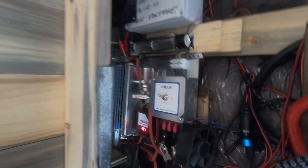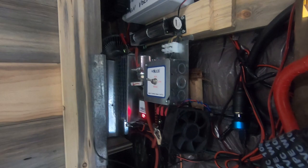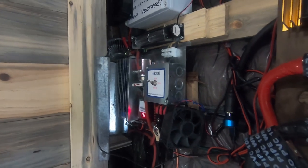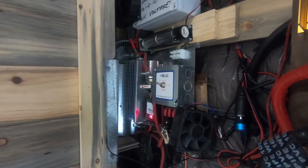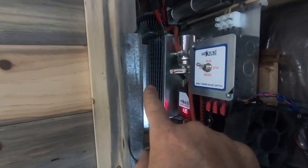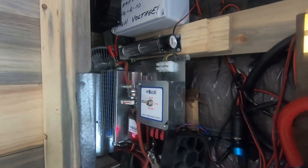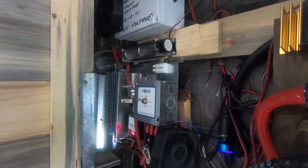This is also going to heat the cabin — this is the cold spot of the cabin in the winter, so this will be nice. I'll probably be using less propane. If you've got a wind turbine dump load, these things get cherry hot. That resistor pack can get hot enough to make steam off water. Now I've got a cooled rectifier, a cooled relay, a cooled resistor pack, and you can see all the heat shields I put on this thing too.